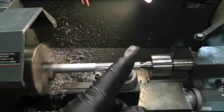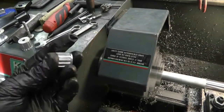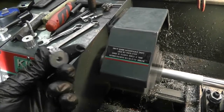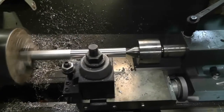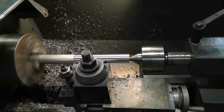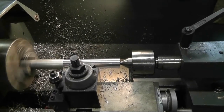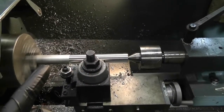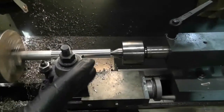Just letting you know what I'm doing — I'm going to cut about seven. These are three-quarter of an inch deep and I'm going to give myself an inch of allowance — a quarter inch of allowance on each end for facing and all that after I part them off. I think what I'm going to have to do is once I machine them all to the correct diameter, I'll suck it back into the chuck and then I'll work on them one at a time.